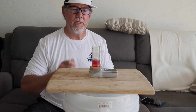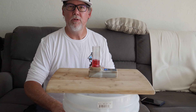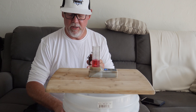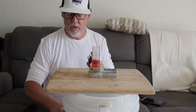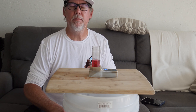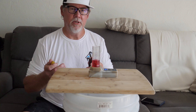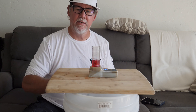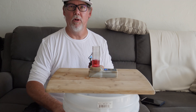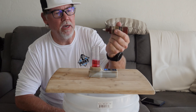The reason I'm doing this is to show you that 24 to 30 ppm only raised the pH from 7.9 to 8.1 — in total from 7.8 to 8.1. It didn't come anywhere near 9.0 like somebody thought. And that person also thought you'd have to pour in a gallon of acid to offset that. Can you imagine pouring in a gallon of acid for that small little rise that's going to go down in about three days anyway?